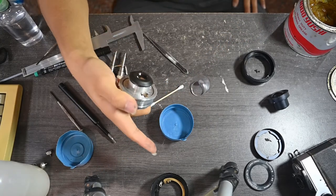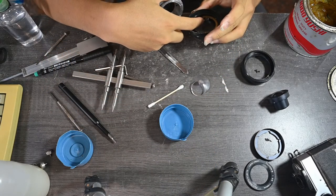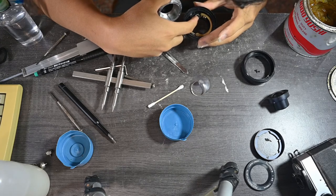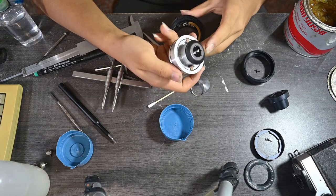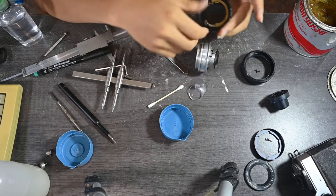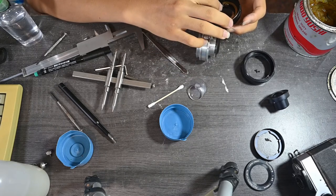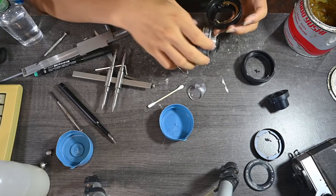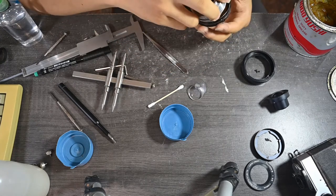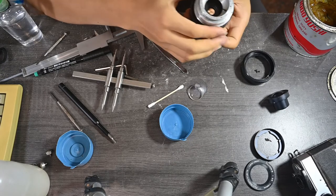This then is gonna go into the back part, I think, yeah. So first you wanna align the lower cup and the upper cup. These things will like grasp onto the pin over here on the aperture, yeah. So then make sure this guy's the f3.5, not 16. Okay. Then you're gonna push this guy in. 3.5. Dropping in. One. Go in.